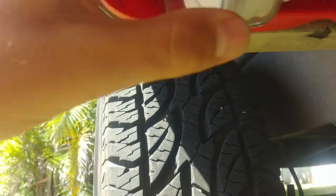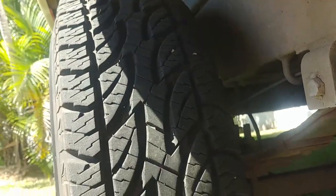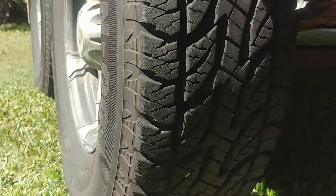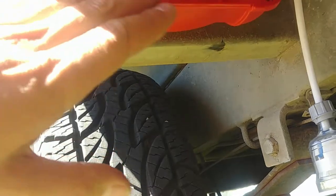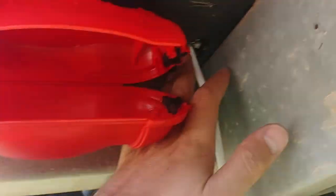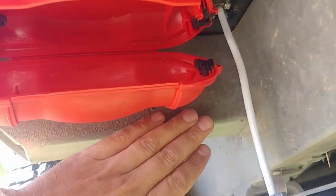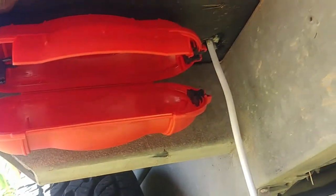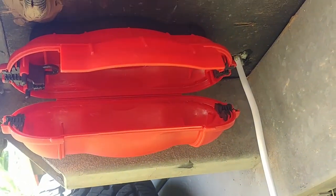I put an extension cord in one end and the other end is blocked up. Being quite close to the tire, there's a chance water could get sprayed up there, though being in front of the tire it's more likely any spray goes sideways and backwards. I've set it up so the hole is as close to the cross member as possible, which already provides some protection from water, and there's also a rubber seal on the grommet.